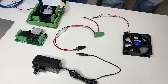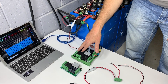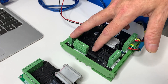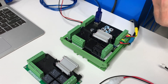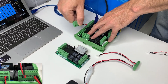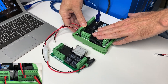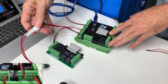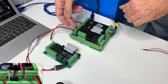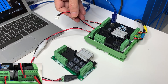In this scenario, we're going to use the Watchmon 4 to control a 12-volt fan using the MOSFETs from the Expansion Board. The MOSFETs will have power fed into them through the Expansion Board, and then feed the power straight back out. We have nothing connected to the relays because it's got nothing to do with this setup. The power comes back out through Output 5 in this scenario.